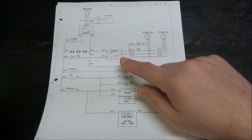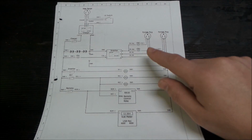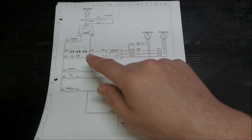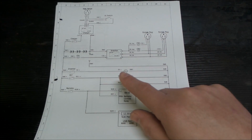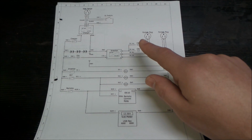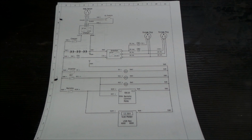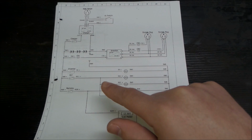Isolation of the charger. Need the inverter to create the 120 volt for our power. And we need to be able to turn on the 120 volt. Again, isolation, you don't have to do that, but it's just something I wanted to do. You need a way to switch the inverter on, that would turn on and off your relays. Now what I wanted was a remote control, so I don't have to be standing at my power inverter to turn it on and off.